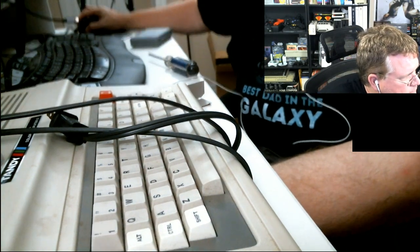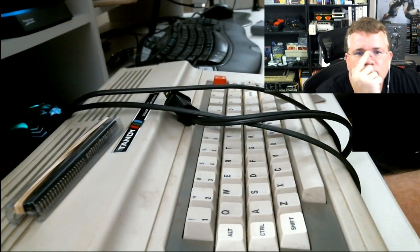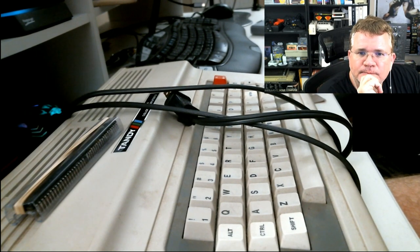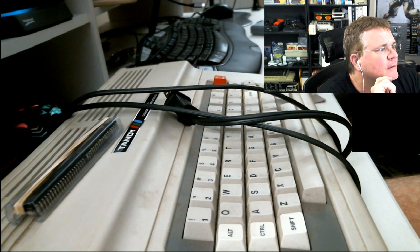In one case, somebody was reselling e-waste. They take all the chips off old junk equipment, and they run all the chips through a grinder to polish off the top surface. And then they run it through another machine that reprints new labels, numbers, and identification on the chips. And then they sell it to you.